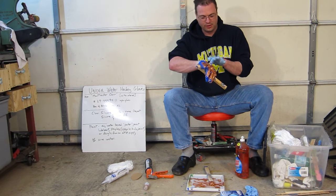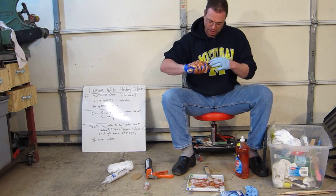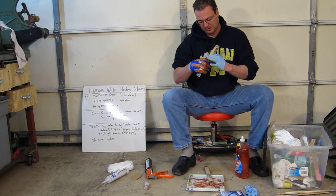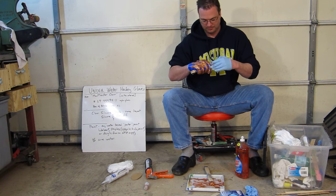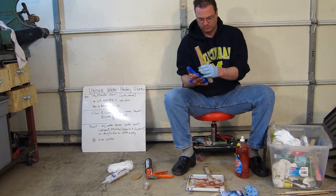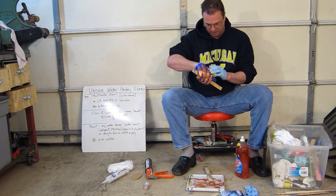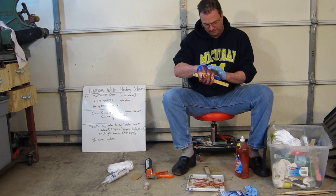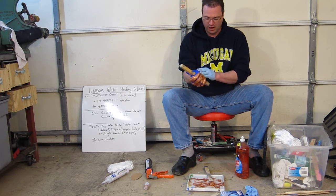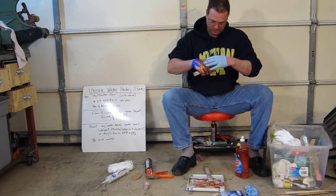The interesting thing too is that the soap is water-based. It actually seems to help the caulk set even faster once you do this. So now the whole surface pretty much has soap on it, and I'm just pushing down the little spikes and what have you that seem to form whenever you mess around with silicone.